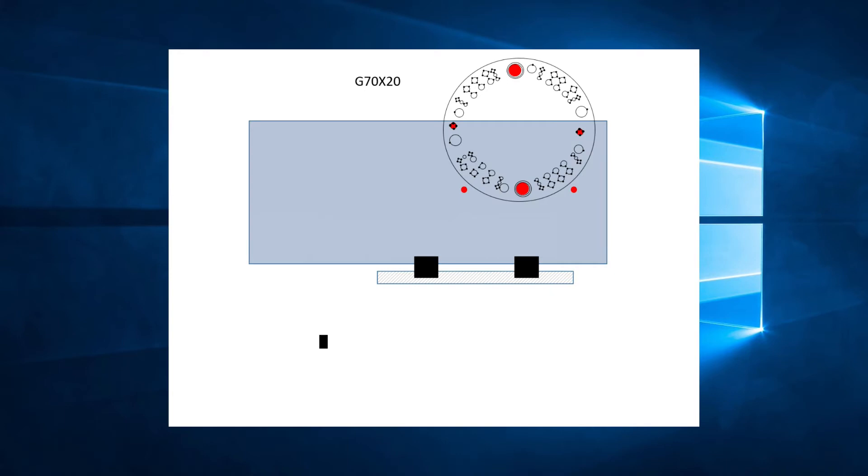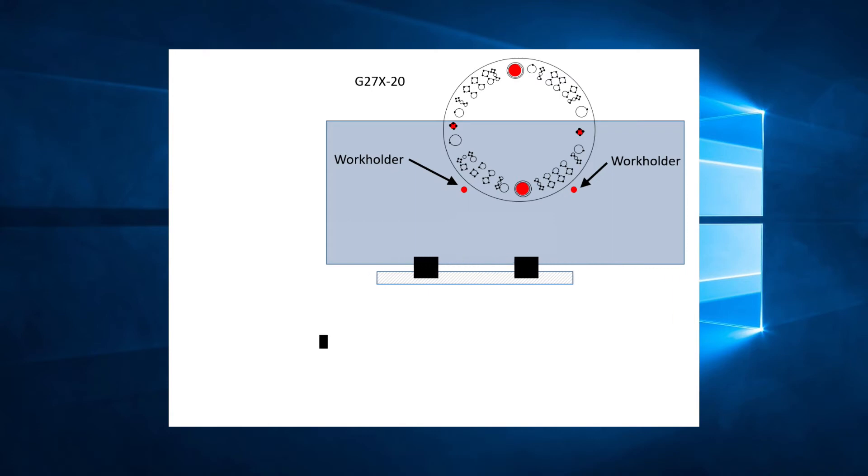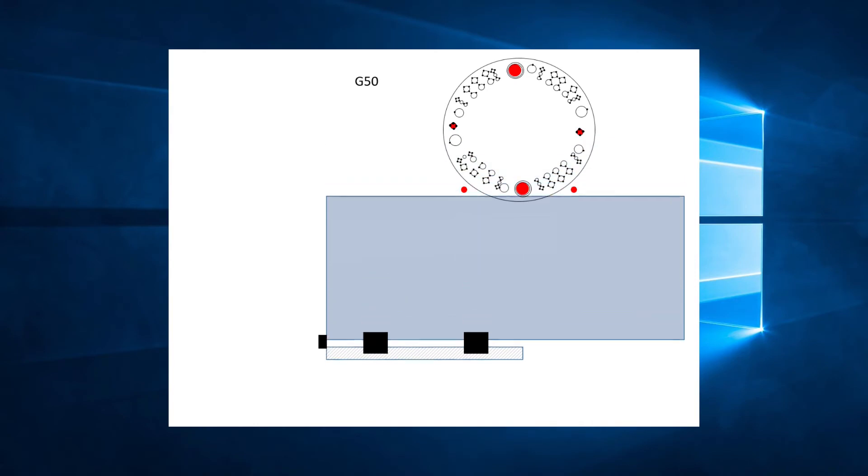So let's do this. First we use G70, X20, Y25 to move the point X20 under the striker. This moves the carriage to the right, giving the carriage the range needed to do a negative repositioning. The next line will be G27, X-20. Once again, the holders come down, the clamps open, they move 20 inches to the left this time, and they grab the sheet. Finally, the work holders retract back up. Now we have the clamps holding the material at the same position as at the start of the program. Next we use the G50 line, and we have a safe program end.